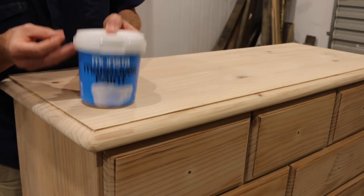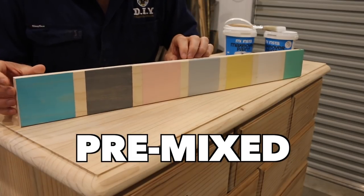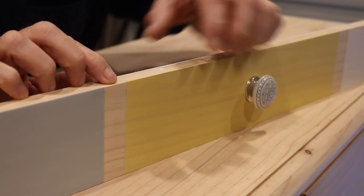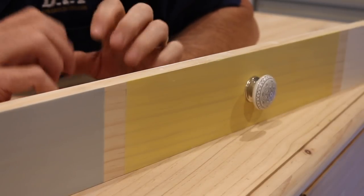Which is why I'm trying this new product from Monster called Colour Wash, that addresses all of those issues. The Colour Wash comes pre-mixed in a variety of popular colours, so you don't have any problems with colour consistency. It has all the qualities of a full-strength paint, and the paint is also translucent, meaning that once that colour wash is dry, the grain from the pine below will show through that finish, giving off that beautiful Scandinavian or whitewashed appearance. Now, just before we start painting, I want to give a big shout-out to the guys from Monster who supplied the paint for this project. If you like what you see, I'll leave a link to those guys in the description box down below. Tell them Uncle Knack has sent you.